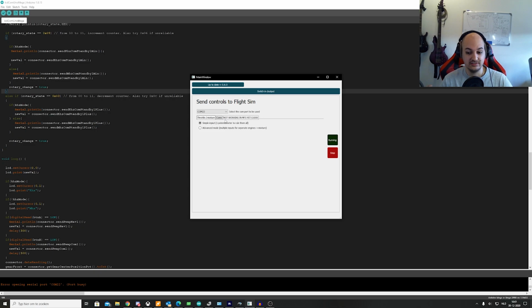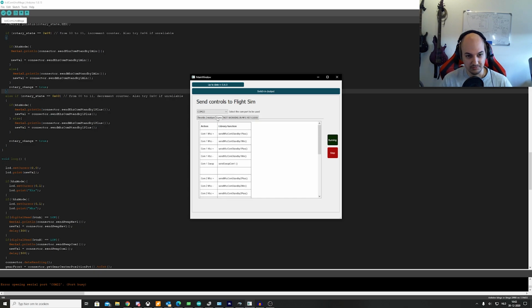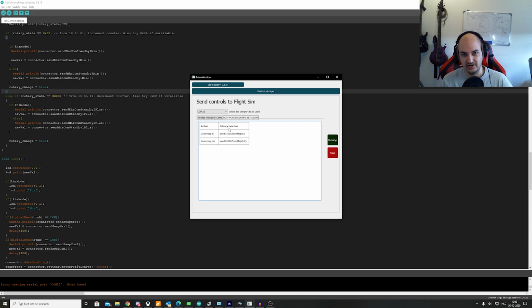And because it isn't receiving data, we don't need the capacitor between the reset and ground like we used to. Now, if we go to comms, we have COM1 megahertz, kilohertz, swap, COM2, nav1, nav2. I still need to do the VOR and DMEs. I was so excited when I saw this one.